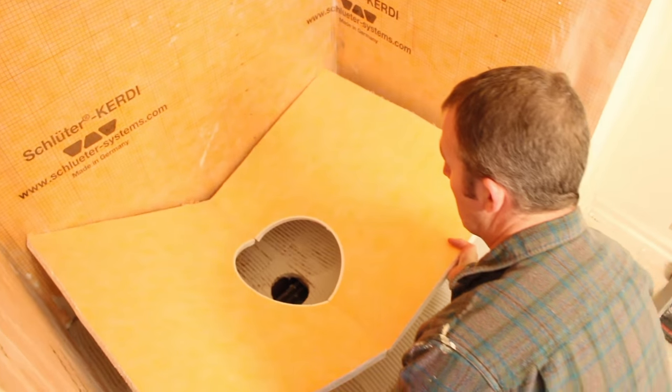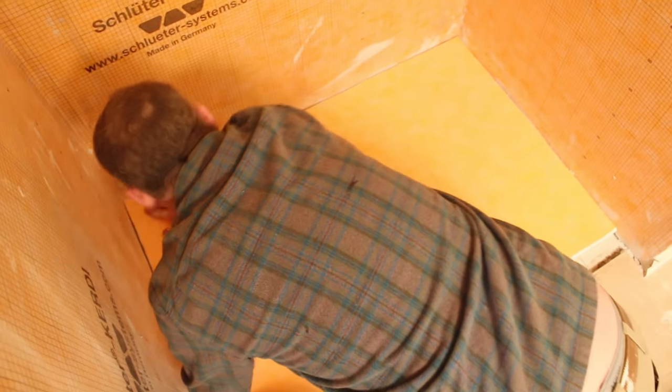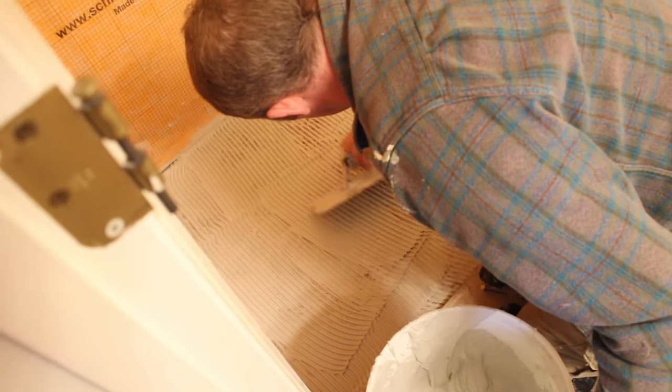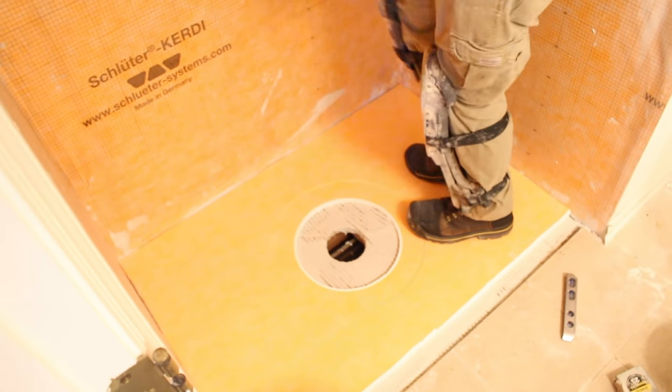In this video we're going to be discussing all the suggestions that the TCNA has for you. First and foremost, before we even begin with the tile, the most important thing is to install the shower pan the right way. In this shower we used Schluter's new shower tray — a pre-slope shower tray. We needed to make sure our joists were 16 inches on center, there was ¾ inch plywood underneath, it was flat and level, and we bonded the Schluter shower tray per the Schluter Handbook.